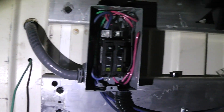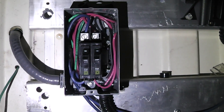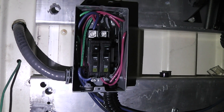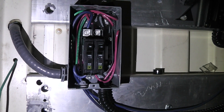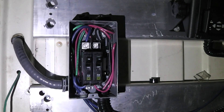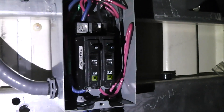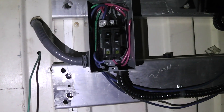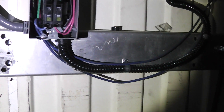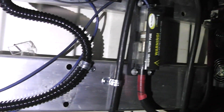Basically, that conduit brings the solar power in here. I've got the runs paralleled, and some of you will notice those are just Square D QO breakers — if you look them up they're good to 48 volts DC. If I were to run those panels in series, 36 plus 36 is 72 volts, I would exceed the capacity of these breakers. So I'm running 36 volts paralleled, and that goes up to the charge controller. It's low voltage, 12 volts, and I've got the main fusing here.